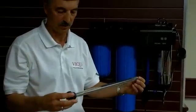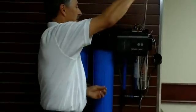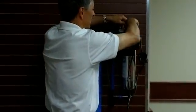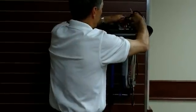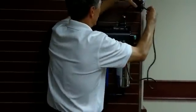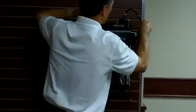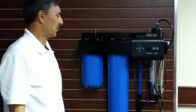That allows the homeowner to inspect the lamp sleeve for any fouling that might have occurred on it, which could be caused by iron or hardness that might be in the water. To put it back in, you simply put it back in — there's a little spring in the bottom that catches it. You screw it back on, then simply reconnect the lamp harness the way it was previously and put the little safety cap back on, and then you're all set. You would plug it back in and you're good to go.